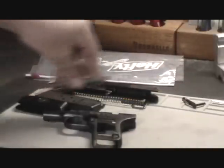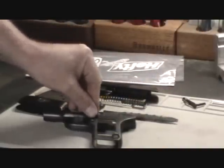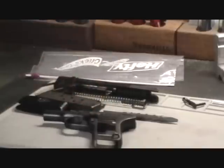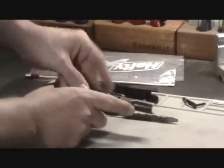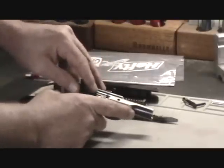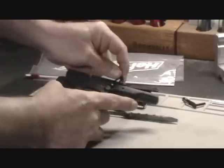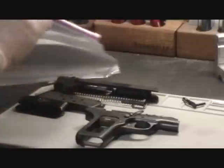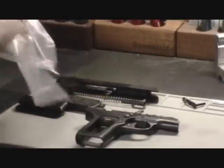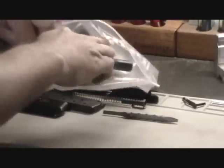The safety is really easy to remove, but there are a couple of little springs and detents in here, and when we take it out we want to keep all our parts together. First, the safety is held in place by a retainer clip, and to free it you just need to rotate the retainer clip free. To make sure our spring and detent are retained and not lost on the floor or workbench, we're going to use a capture bag to remove these parts.